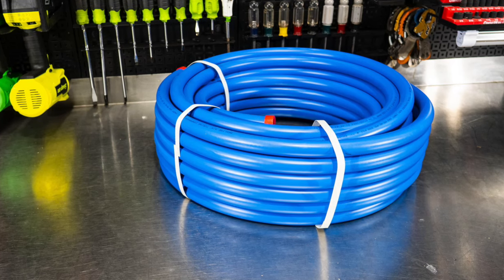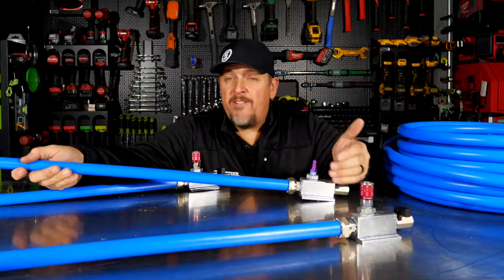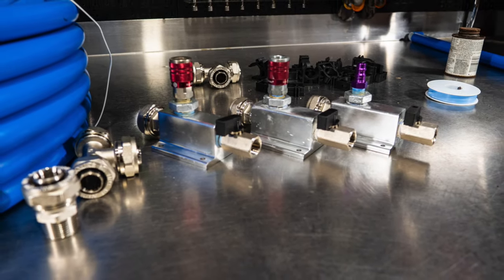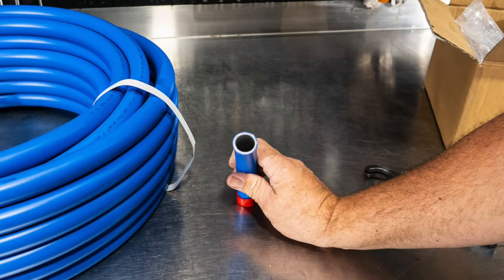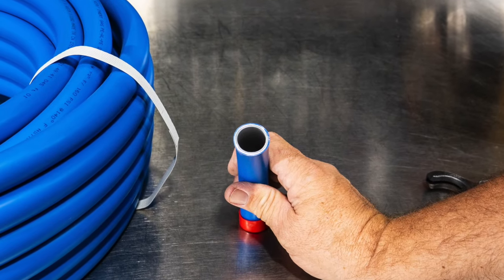As long as you know you need less than 100 feet, this system will probably do it. And it's going to provide you with like 3 different drops, including the quarter turn dump valves. Most all of it is either stainless or nickel or brass, so built really, really well. And also the airlines are not just HDPE. There's also a layer of aluminum in there as well.